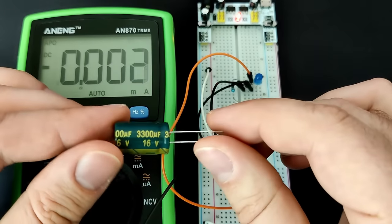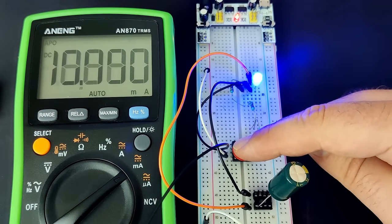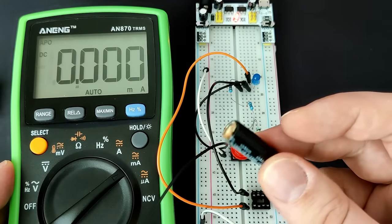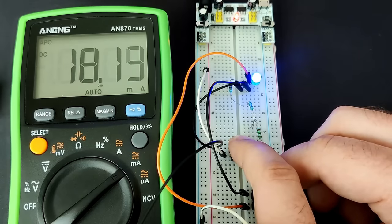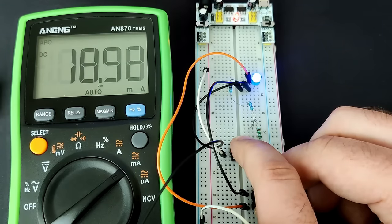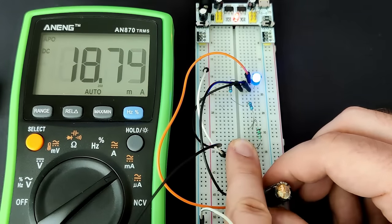With the green capacitor in place, there is a very short delay before the LED fades quickly into full brightness. When I release the button, the LED fades out slowly — it takes several seconds before the LED is completely dark. Now with capacitor number 1 from the motherboard, the LED fades in a lot slower and does not shine as bright. When I release the push button, the LED immediately goes dark with no fade out. The multimeter reports over 19mA — this capacitor has over 20% V loss and appears to be leaking a lot of current.